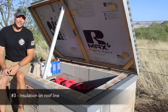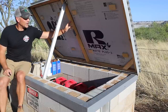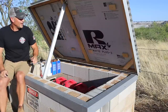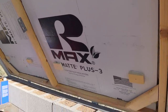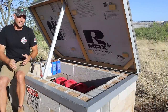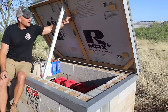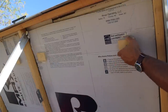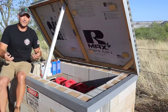Also related to ventilation and heat buildup, a lot of you guys commented about not having insulation on the underside of the roof. So I went exploring through my scrap materials and found two pieces of R-Max insulation I had used on my DIY travel trailer project. It's pretty cool stuff — very high temperature resistant and it's a half inch thick, so it's not going to do a lot of insulating but it'll take the edge off. I attached it with screws coming through the sheet metal and then threaded some pieces of plywood over the screws, and it holds on pretty well. I can hold my hand in there and tell a difference even this late in the day.